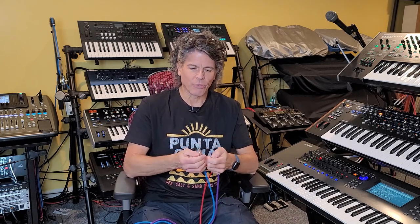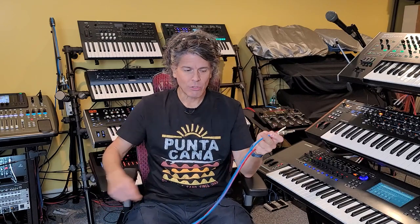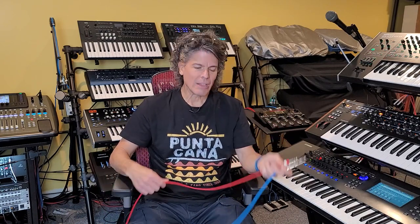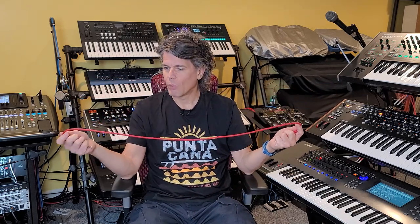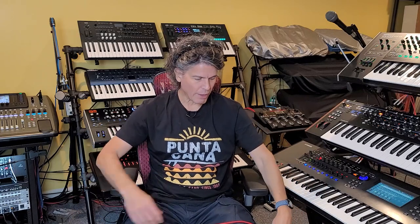Let's start by talking about electrical signals. We have two wires: a ground and a signal. You can't just have a single conductor because electricity can't flow through one wire and go nowhere — well, you can, but that's called lightning. What we're talking about requires a complete circuit: it goes down one wire and comes back through another. That's why a simple consumer-level audio cable has two conductors.